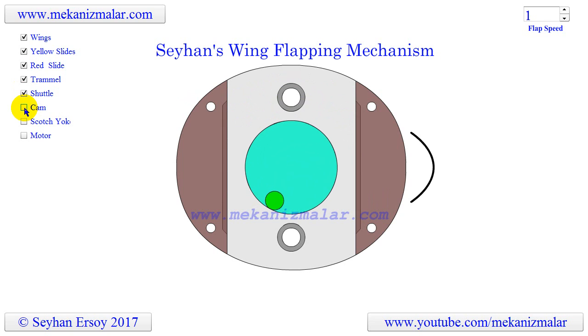Now what we see here is the Scotch yoke cam. The green circular tongue-like extension of this cam slides inside the Scotch yoke slider. The bottom part of this cam has a cylindrical shape which rotates inside the groove located on the Scotch yoke body plate. When we remove this cam, what we see is the Scotch yoke body plate. The Scotch yoke body plate will be used to hold all the assembly parts together and attach a motor to the mechanism.